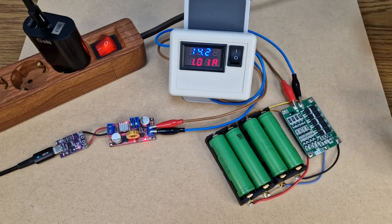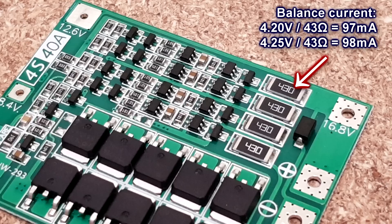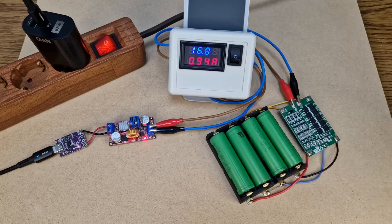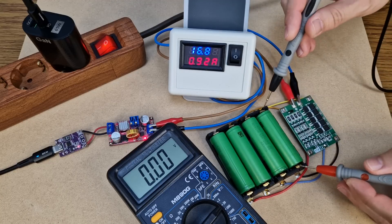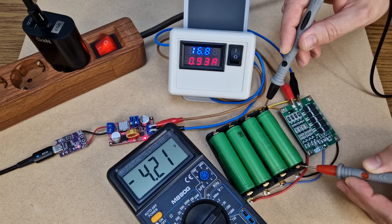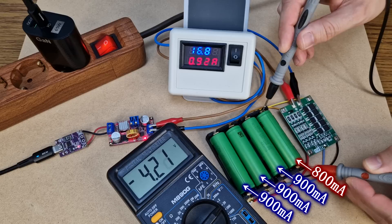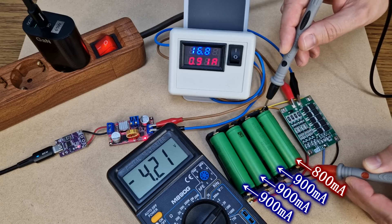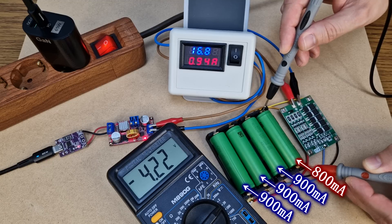The battery voltage is 14 volts. I will fast-forward the video and we can see the voltage increasing with a current limited to 1 amp. This BMS board has a passive balance feature starting at 4.2 volts for each cell, with a balance current of around 100 milliamps. After 1 hour the charging current is starting to decrease. The first cell has more than 4.2 volts, so the balance process has started — it's being charged with 800 milliamps, 100 milliamps less than the other cells. This will help the other cells charge faster and catch up. The cell with the highest voltage is being charged with less current than the others — that's all there is to passive cell balancing.